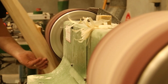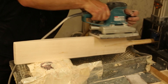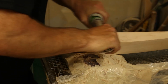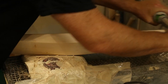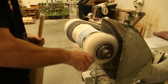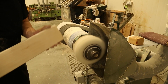The drum sanding gives the final weight of the bat and the smooth profile that we're after. Once that process is done they move on to the next stage which is fine sanding — it's orbital sanded and we bone the edges on every single bat. This just ensures that the edges are nice and hardened. Once that's achieved we're ready to polish the bat, polished with beeswax, which seals the blade ready for an oil application just to stop it drying out.